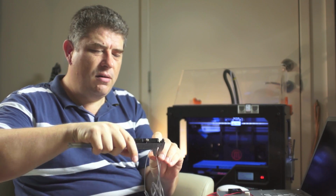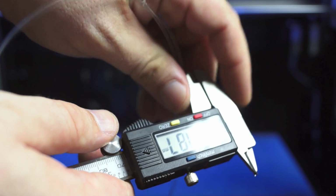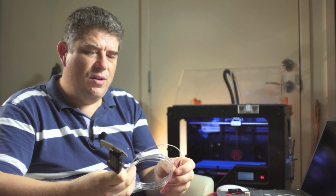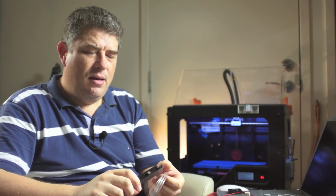And so if you'd just done the reading in one dimension, compared to the side reading as well, you'd actually end up with different numbers. So you've got to do vertical and cross section of the filament, and you've also got to run along it a bit to get a sense of what the variation in the filament diameter might be. And then the question is, what do you print at? For this, I was printing at about 1.8 because I found on average that was what gave me the best result. So the measuring, as I see it, provides you with a starting point,